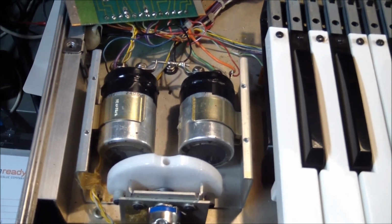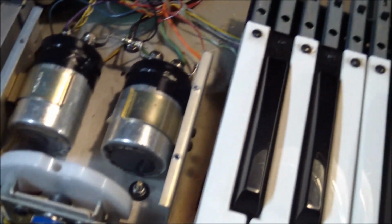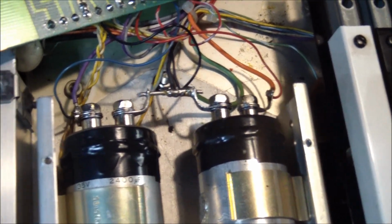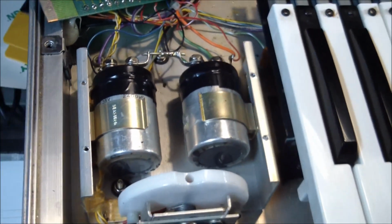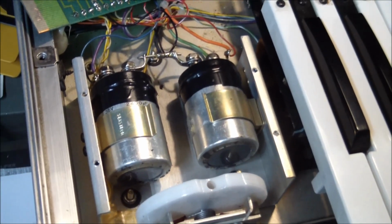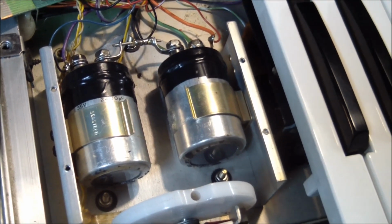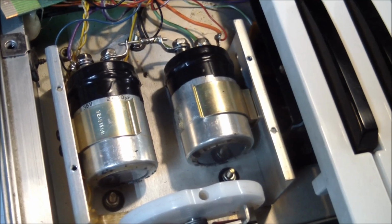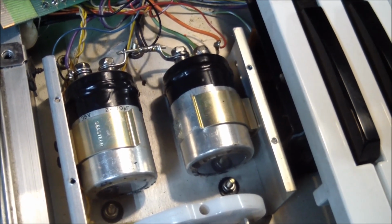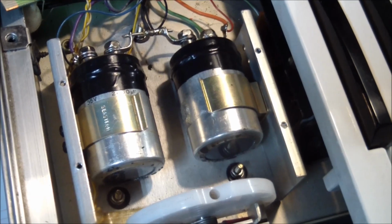So the cap stuff took a little bit longer than I hoped it would take, but it was the right approach to take, because I hot glued them back together and put a piece of tape over the seams. But basically the wires and the screws fit on just like they were before, and it's much neater and much more secure. And after measuring the voltages, I now get plus minus 25.5 volts with a ripple of approximately 150 millivolts on each side. So it definitely needed the caps, and it's going to make tuning the oscillators a lot easier. Well, not necessarily easier, but they are going to remain much more stable with a better source of unregulated DC voltage coming in.